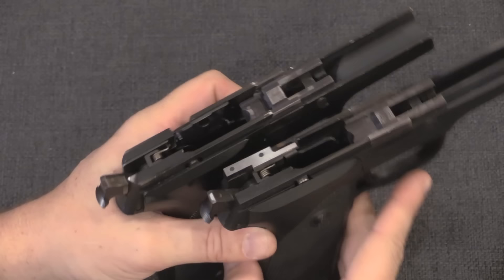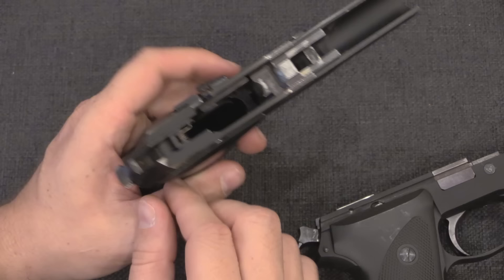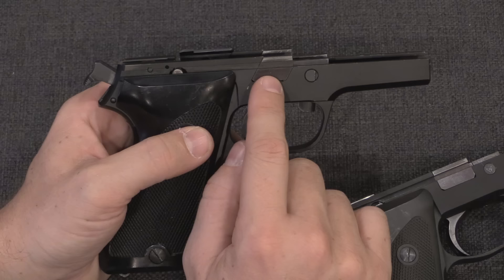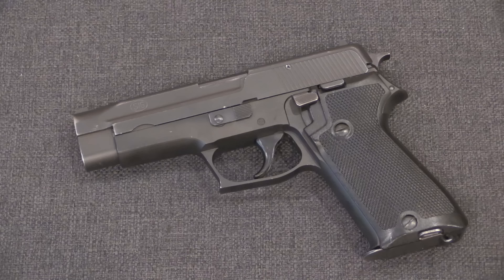Comparing the frames of these two prototypes: the first one had a fixed ejector at the back. In the second prototype they've evolved the design — the ejector is now a thinner stamped piece that's pinned in place, instead of being connected back to the fire control group. So in this design we're really getting very close to what would be the final military version of the gun. However, you can still see the steel locking block in the front that has been dovetailed into the frame, and that would still need to change.